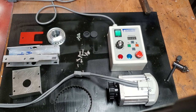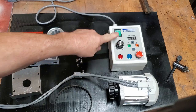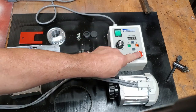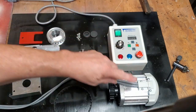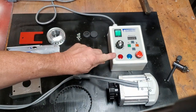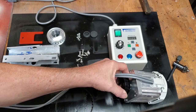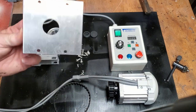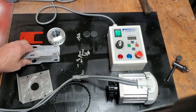The kit comes with the new controller, 7 amp thermal overload, reverse on the fly, e-stop, 10 RPM increments, top speed 4500 on the motor, low speed 200. The motor comes with the pulley already on it, a drive belt, and this is the belt cover — it's unique to the brackets because they're made individually.